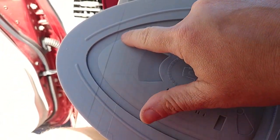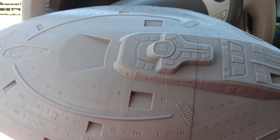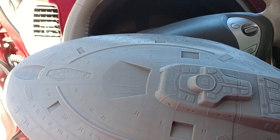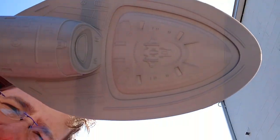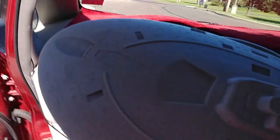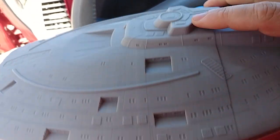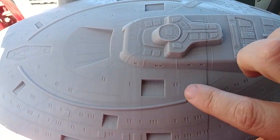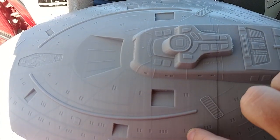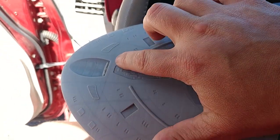Here it is — it's more severe over this one up here. That's where the support starts, and the other line is actually a softer line where the support ends right there. So that's the banding where the support is, and this one here is where I added support to support this section.